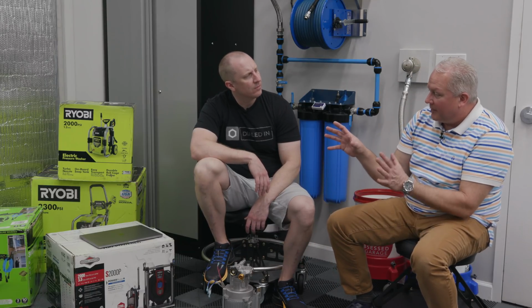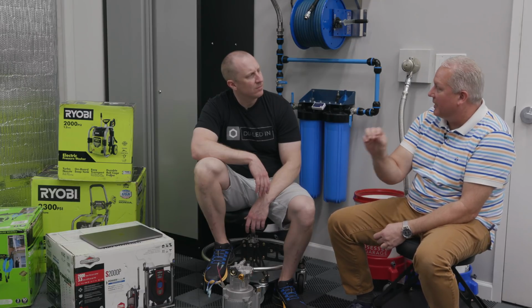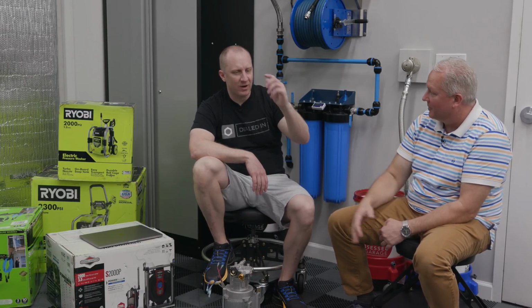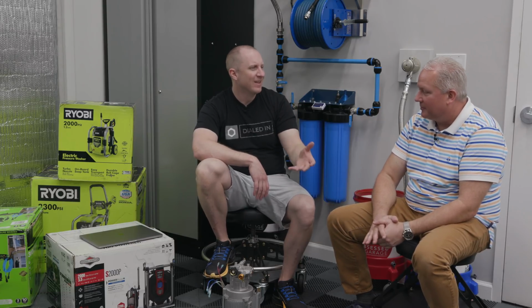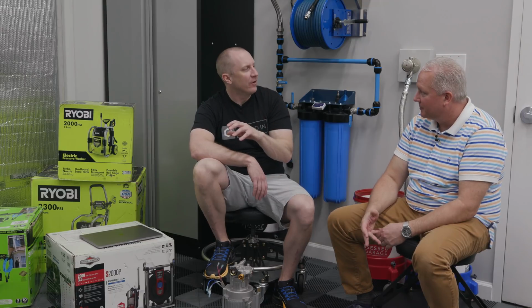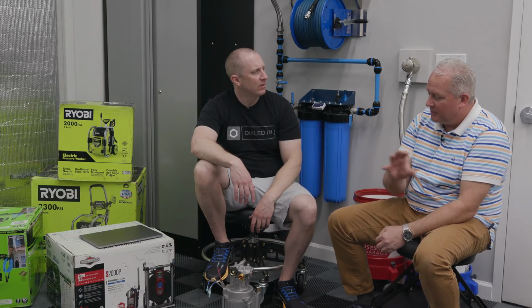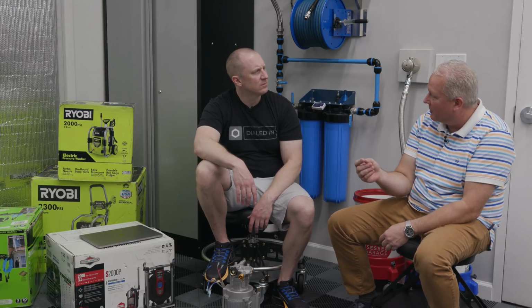Now, if you're a member of the PWMA, you use those standards, right? So you're always going to have an M22. That's why Greenworks, Ryobi, Briggs and Stratton are all using the 14 millimeter standard. And then it seems the Chinese standard, or no standard, is to go 15 millimeter. Sure. So I think both 14 and 15 were very common in the market, let's say mid-90s, when some of the standards started to come out.